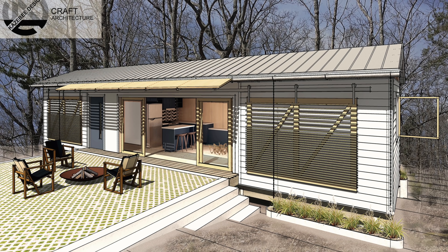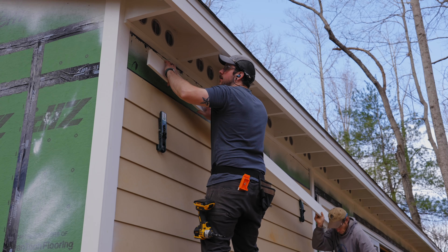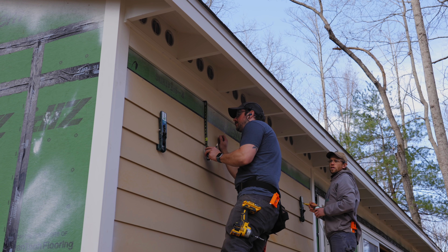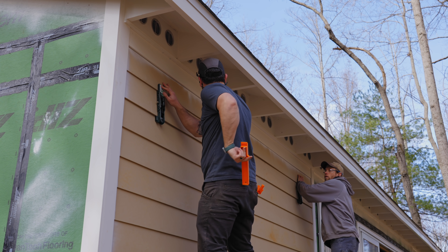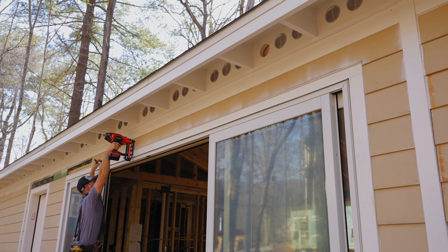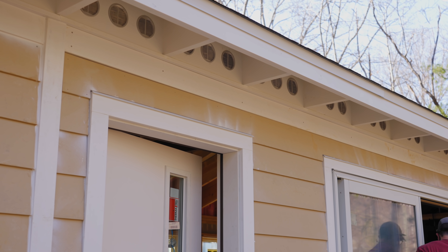As we got to the top of the wall, we needed to add one more piece of PVC trim to provide a mounting location for sliding barn door style privacy screen brackets. After getting that PVC trim installed, we could get the last row of siding installed, ripping it to width. If the last piece ends up being a super narrow piece, you might want to add a spacer strip behind it to make sure the angles match up. A tip from the Perkins Brothers: use finish nails on this last row so the nail holes disappear — they're plenty strong and it looks a lot better in the finished install.